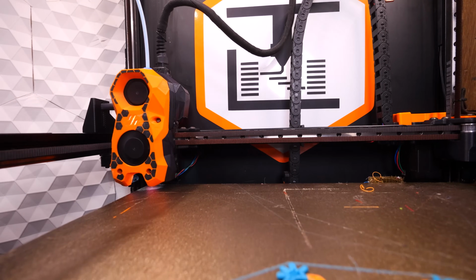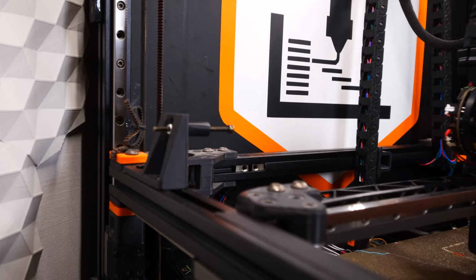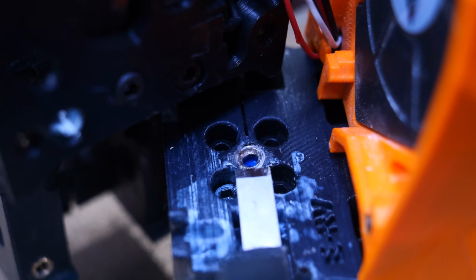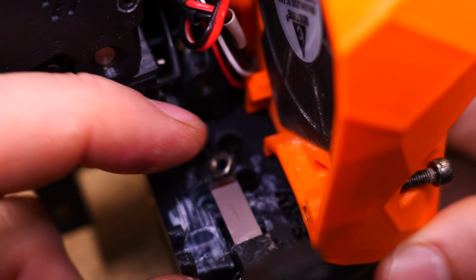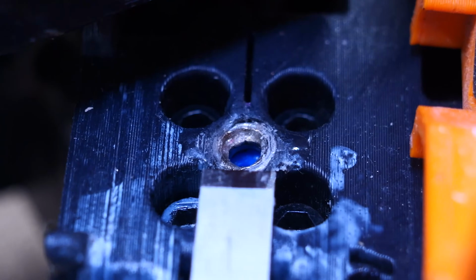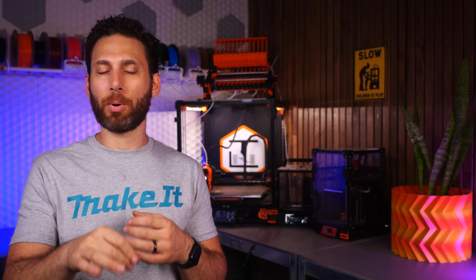The next thing that you're probably going to want to do is install and configure the filament cutter on the toolhead. Now you will need to mount that little pusher pin on the gantry and configure it in the firmware so that the firmware knows where it should go to cut the filament. Also, I recommend triple checking that both the hex nut and the PTFE V-tube in the toolhead are chamfered, and that the hex nut is either glued down or sufficiently stuck in the plastic. Remember that from now on, the ERCF and the extruder are going to be the ones pushing in new filament, and they won't know to wiggle or turn the filament if it doesn't go in perfectly the first time. That'll save you a lot of errors, trust me.